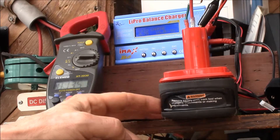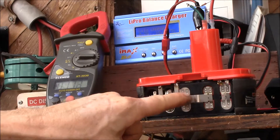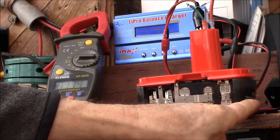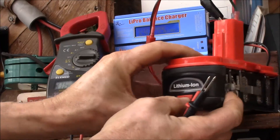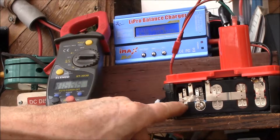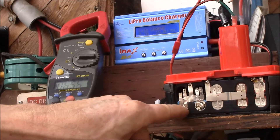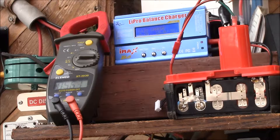What I did was charge these original cells several weeks ago and then let them sit, and they had dropped down to where the fuel gauge was showing yellow - and it's still showing yellow now, so the voltage is still low. But the two new cells are charged, and as long as there's at least one fully charged cell, the protection IC won't let the pack charge anymore. That's a weak point of this IC: as long as one cell is above the threshold voltage, it considers the whole pack charged. It doesn't care if all the other cells are dead - if one cell is above 4.1 volts, it shuts down.